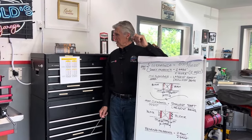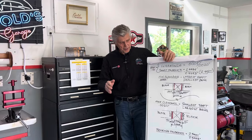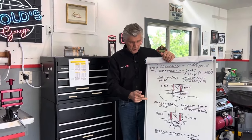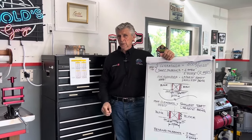I hope you find that helpful — understanding tolerances and how the factory did it. They didn't measure anything on the line; they knew the shaft was made to tolerance and the bearing was made to tolerance, and they knew that worst case scenario it was going to be within tolerance for the clearance.